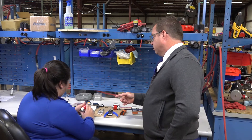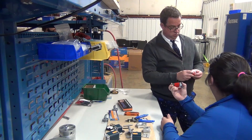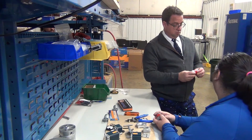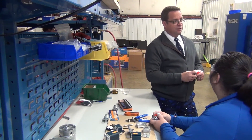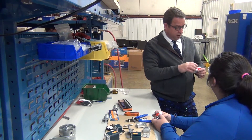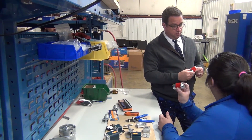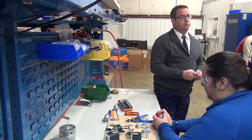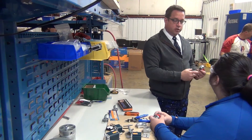So the motors — I know we've got some new things about the motors. What's up with those? So this is our Redline AndyMark 775A version. This is a motor that's 10% faster than our previous version, and therefore has a higher wattage as well. The letter A. So I can see on here there is a '775A' at the end of this 775 part, and that tells me this is 10% faster. So you may want to be careful when using these motors alongside the older version, making sure you know which version you're using on your robot. Some teams might want to change their ratio depending on what motor they're using. Even though a 10% change isn't a lot, it might be enough to go to the next stage of ratio.